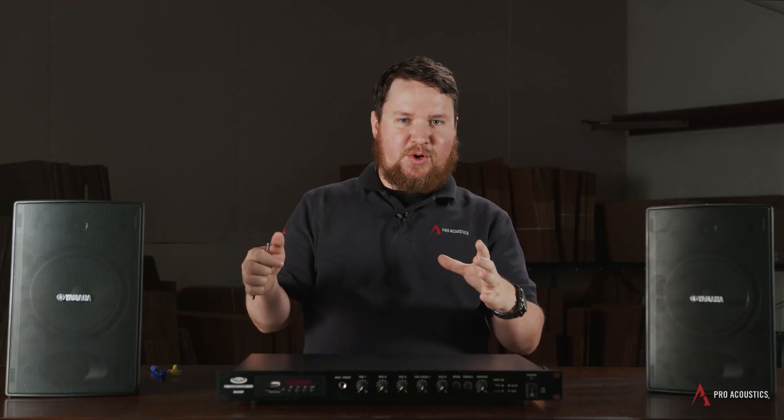Typically, we want to tap speakers at basically the highest available tap setting for the application. In cases like restaurants and things like that, we normally don't need 200-watt speakers, so if you've got a speaker with a 200-watt tap, you probably don't need it quite to that level. But if you're doing a sports bar or restaurant that might get a little rowdy, on a speaker like this with a 25-watt tap, we probably don't want to start at the 2-watt setting because it's not going to be very loud. It's normally a good idea to shoot for the middle tap setting, if not one of the higher tap settings, when determining how much wattage you'll need.